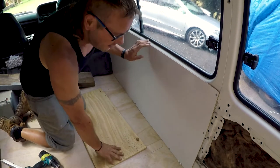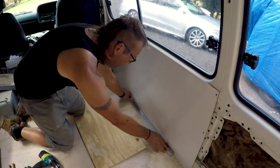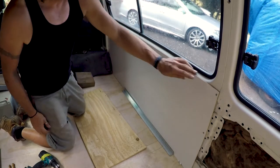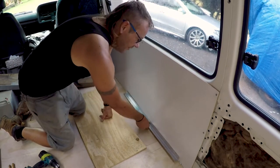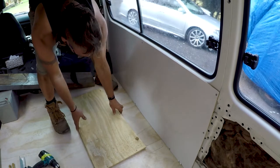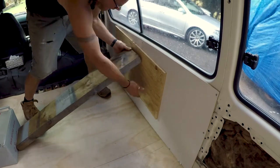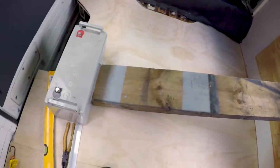I'm only putting a few screws in along the bottom and the top because along the bottom we're just going to put a piece of angle to finish it off, and that will also keep it in place down the bottom. Across the top I'm going to run just a small timber cap on it, so once that's screwed on it'll keep the top in as well. We won't be putting the stripping on down the bottom until the vinyl goes in, so we'll just put a couple of screws in there now to keep it in place. All we've got to do is put a bit of pressure on that in the middle so that the lining board is holding pressure against the panel there to hold it in place while the glue dries.